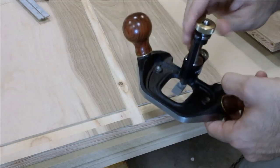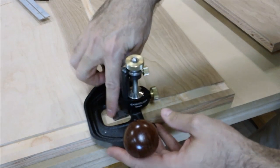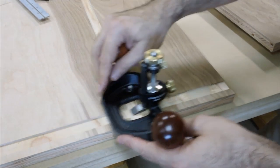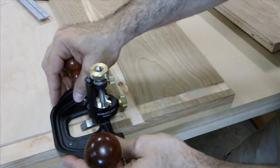So let me show you how to use this — it's very straightforward. You basically want to set the blade to a known depth. For instance, at the beginning of my cut, I know that I'm exactly an eighth of an inch, and that's where I want to be. You can see that my blade is set so it's not cutting any material there.